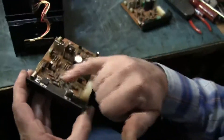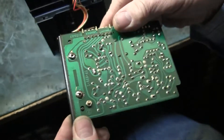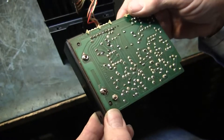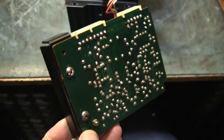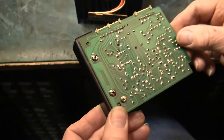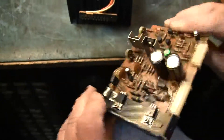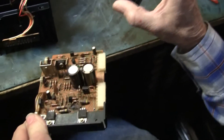I pulled them — these are good. Put it all back together, got the schematic this morning. I've come to the conclusion that when they replaced these drivers, they didn't tighten the screws, which are the collector connection to the circuit board. They lost collector voltage to one of the drivers, and the current came through the bases of the outputs through a pair of resistors to the midpoint and through the speaker, and smoked the resistors without damaging any semiconductors. So I soldered the screws in, made sure the washers were clean, torqued the nuts down, and went to the other board — made sure its nuts were tight, and they weren't. That may be all it was.